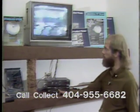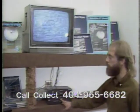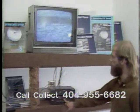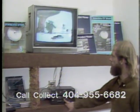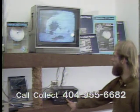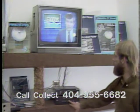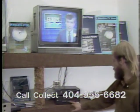Initially I will be in between all of the channels. Okay, I am below them now. I start coming up. The first one I hit will be channel 1. There, and the second one I hit will be channel 3. Then fine tune for my best picture on channel 3 and hit my store button.